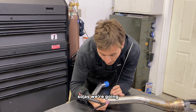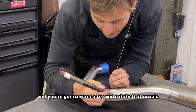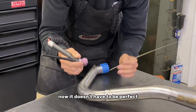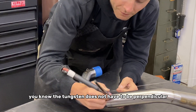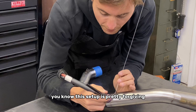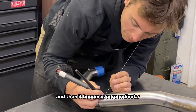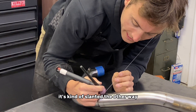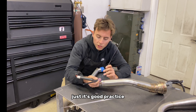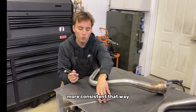When you're welding, you're going to start that weld and dip, and you want to try to rotate that nozzle with the tube as you go. Now it doesn't have to be perfect — the tungsten does not have to be perpendicular with the tube all the time, just do the best you can. This setup is pretty forgiving. If you start your weld with the torch slightly slanted down and then it becomes perpendicular and then finishes slightly slanted the other way, there's nothing wrong with that. It's just good practice to try and rotate that cup with the seam — I think your weld is just going to be more consistent that way.